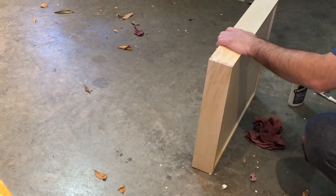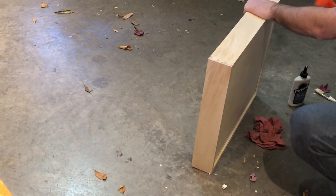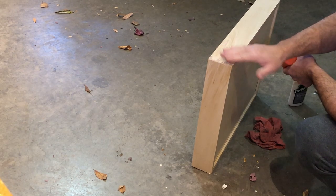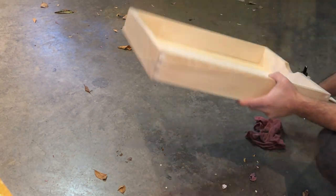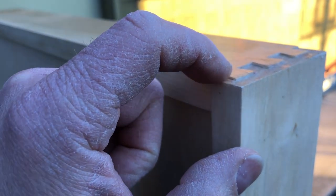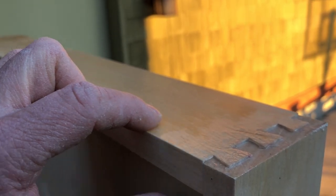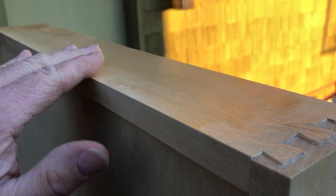It's all in. Now, sometimes there is variation in how these are cut, so this is a little bit raised — I'll get my sander and I'll sand that and it'll be good. So this is the drawer. My drawer is a little bit too wide, and I think because my dovetails are sitting a little proud. So what I'm going to do is take a planer and take this down to flush, and that should be enough to give me that little extra clearance so that the drawer will operate smoothly.